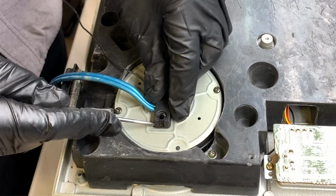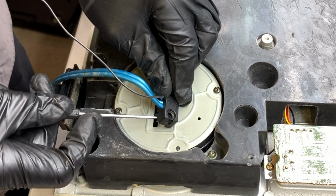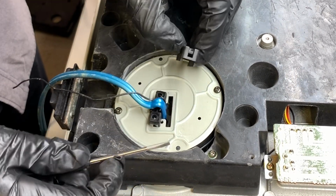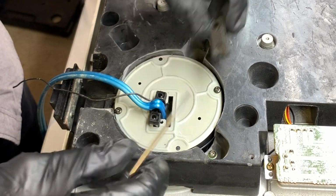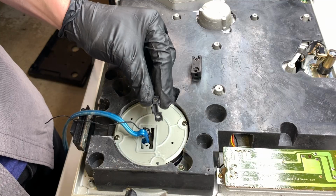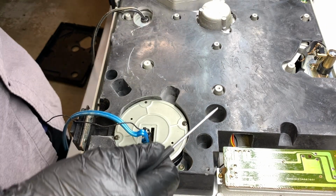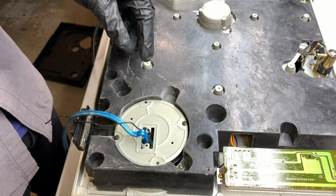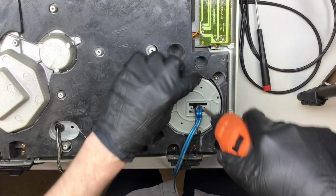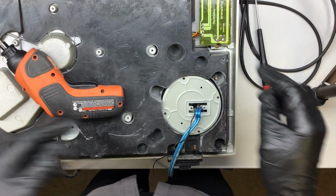Okay, so here's the RCA clamper, and if there's a little tab on the side, I'm going to put my screwdriver in and lightly pry it up, and that will separate it from the bottom. This is the RCA clamper officially. This is the spacer, and I'm actually surprised that it's in here. Most people who work on RCAs at home just throw it away because they can't figure out how to return it to its original position. All right, so out comes the plate. And usually cockroaches love to be in there too, so we'll see.